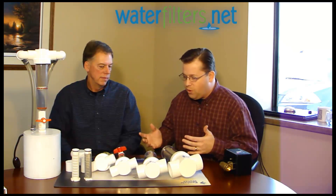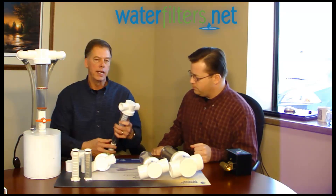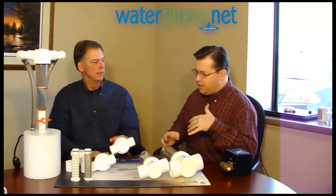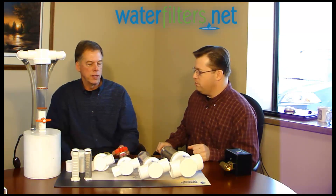What is it? What do I use it for? Why do I need one? Rusco is designed for sand, sediment, and hard scale — stuff you can physically see with the naked eye that's going to settle out in about 10 seconds. So if I've got cloudy water or really fine silt, this isn't for me? No, for that you want a backwashing sediment filter. This is for the bigger chunks.